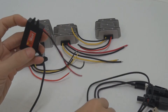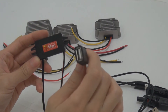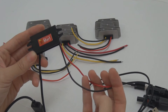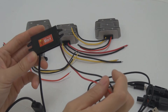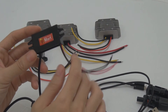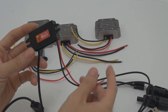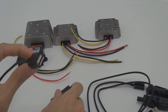What this unit does is the output is USB — basically 5VDC output. The input is 12V. So you can connect it directly to your charge controller, or connect to a battery, or even connect to a solar panel. I'll talk about the solar panel later — but let's say directly from your charge controller. If you have a 12V battery bank, your charge controller will give you about 12VDC output as your input.